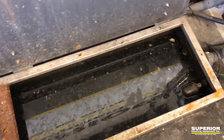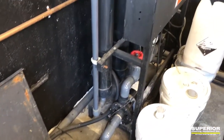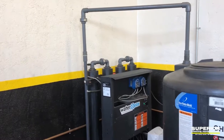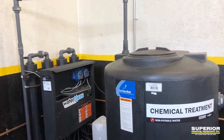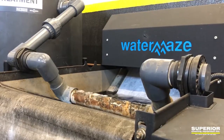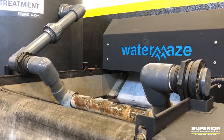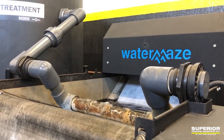What we're doing today is showing you a little bit of our chemical treatment process. The chemical coag you can see is mixing flocculation chemicals in there — EC Plus and a compact coag — and we've got a treatment tank. From there we're running it right into our indexing paper filter, which right now is automatically indexing, taking out some of that flock and that coagulant.